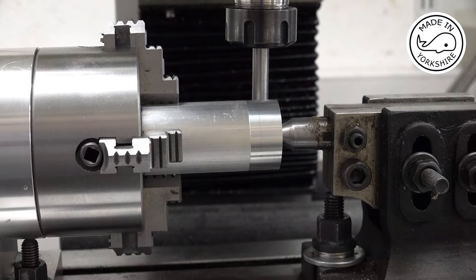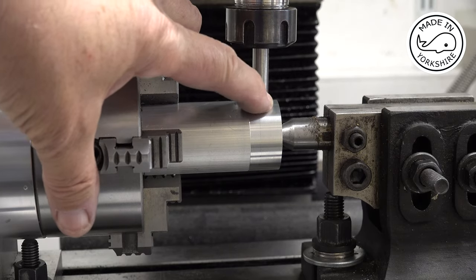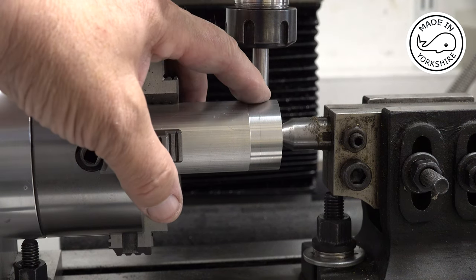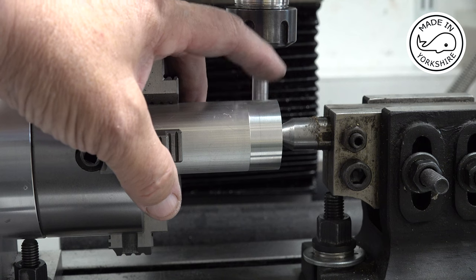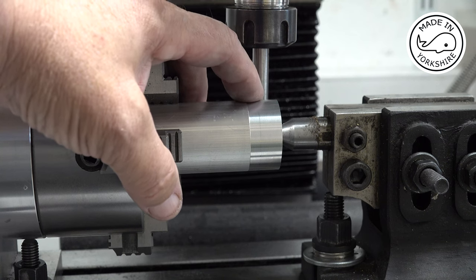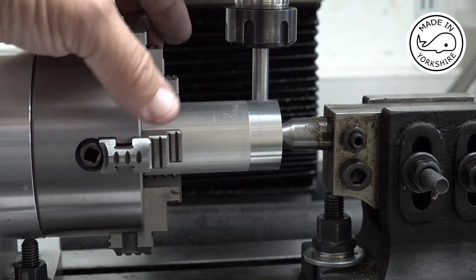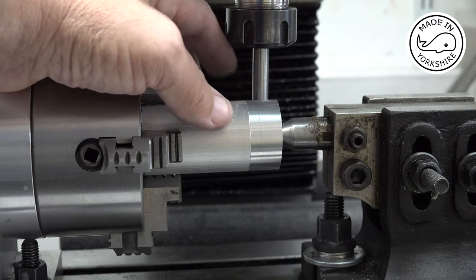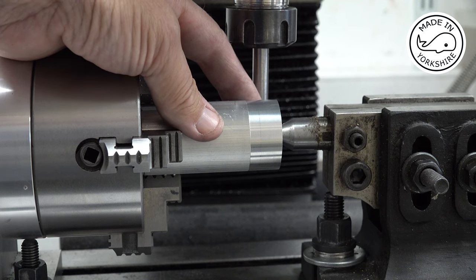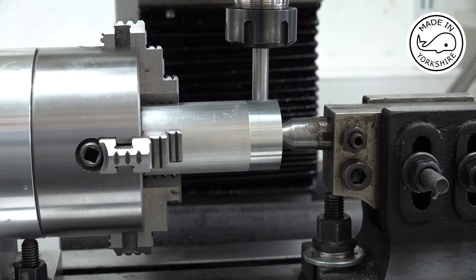Okay, so there's another test. What I'm going to do is cut a 70 tooth gear on this piece of aluminium. The diameter of this should be 70 plus 2, 72 divided by 48, which equals one and a half inches — and that's spot on one and a half inches. So I'll start everything up, move the cutter just to touch it, then advance the table 45 thou and make the cut.